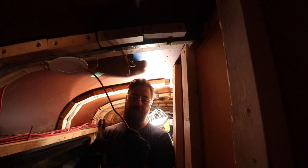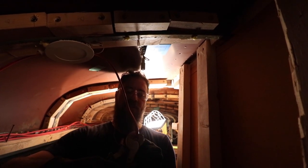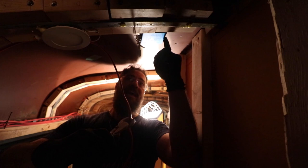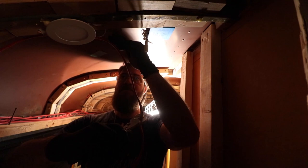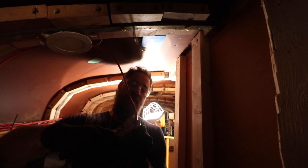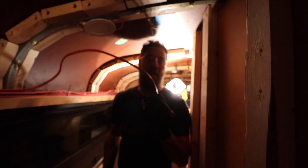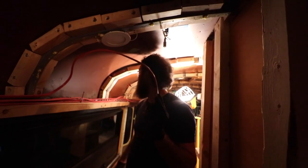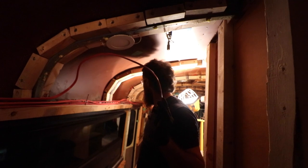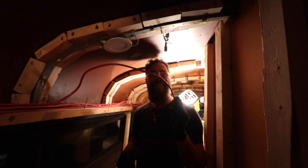So you've been cutting it just so it extends past the box, and then you find you've had the right amount of wire. What I've been doing is extending it to the edge of the box. So if it's coming in here, when I cut it to this length, after having enough for the gentle bends and everything, it seems to be just enough for what needs to happen in there without being too long. After I'm done, let's see, 4, 8, 9, here's the 10th one. Yeah, 10th one.